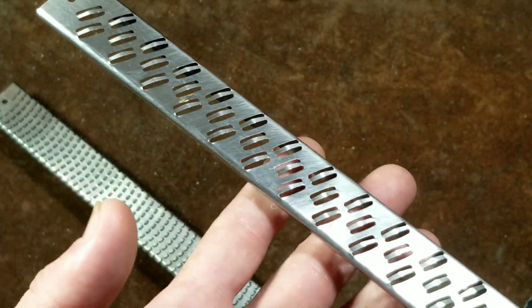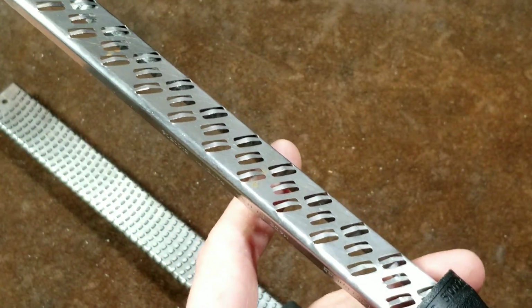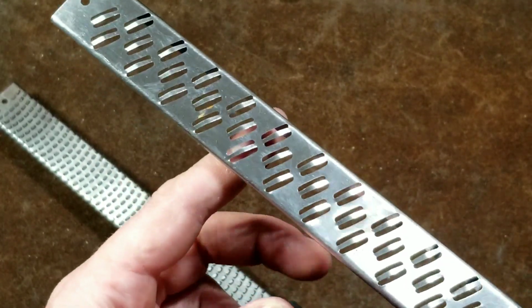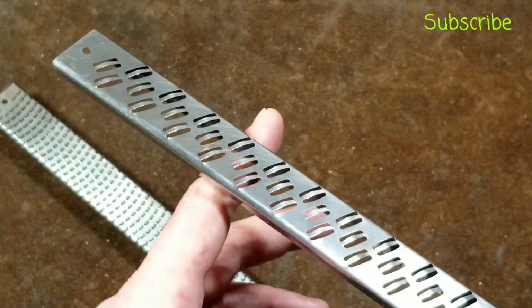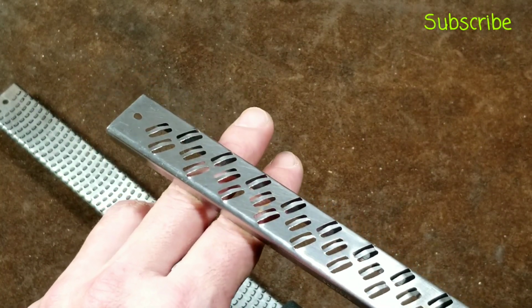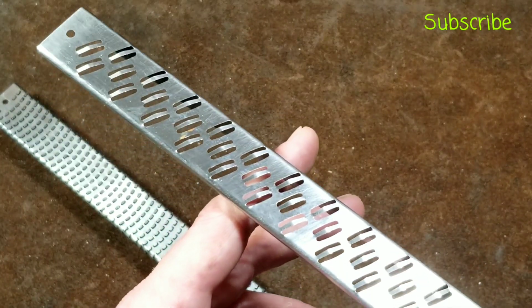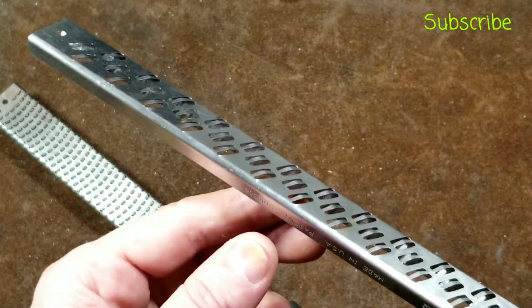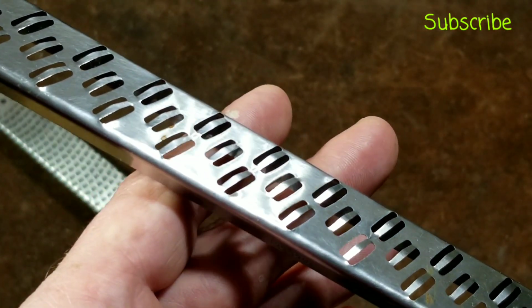They're not going to be the very hardest of steels because no stainless can achieve extreme high hardness. They can have strength and durability and heat resistance, but they just don't achieve the highest hardness. And so for a MicroPlane, if they're using a quality stainless, they'd be using something like 440C, which is a very common, decent grade or good grade of stainless knife blade steel. And if they were real special, then they might be using a precipitation hardening type of stainless. But they don't actually advertise specifically what grade of steel they're using. And I find that a little bit unfortunate, but they seem to hold up pretty well.